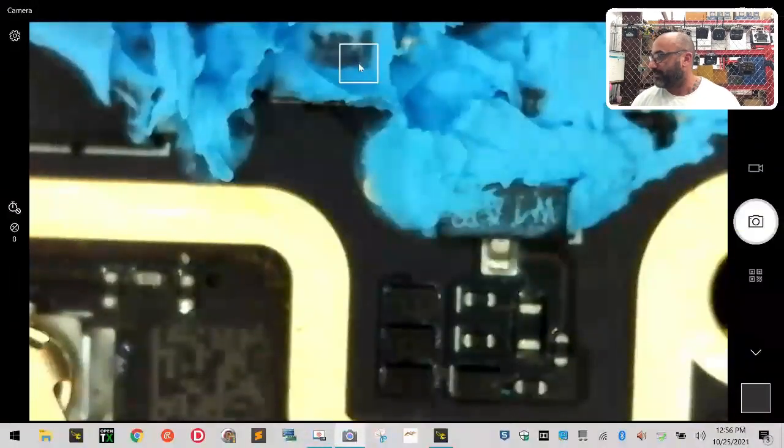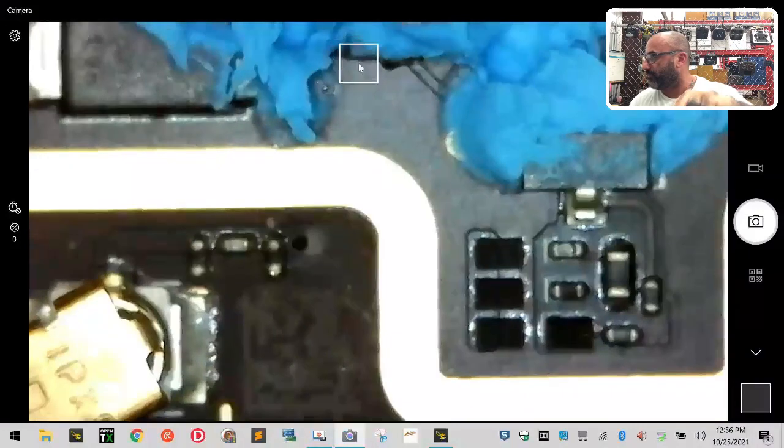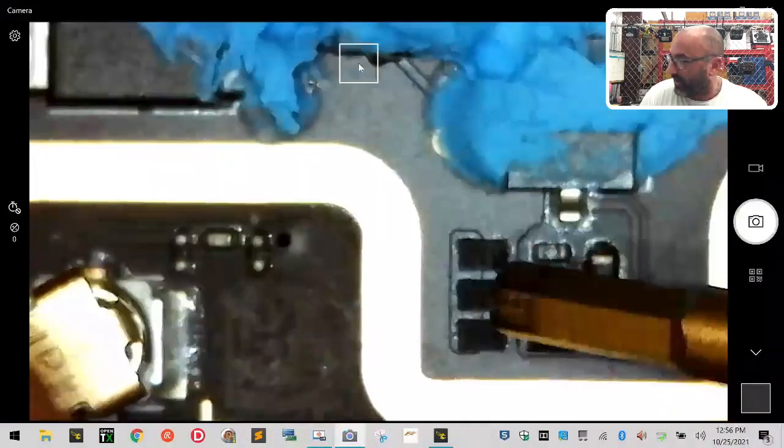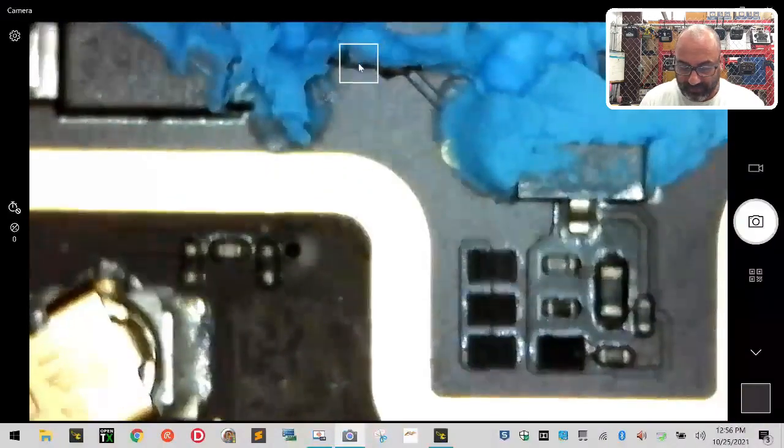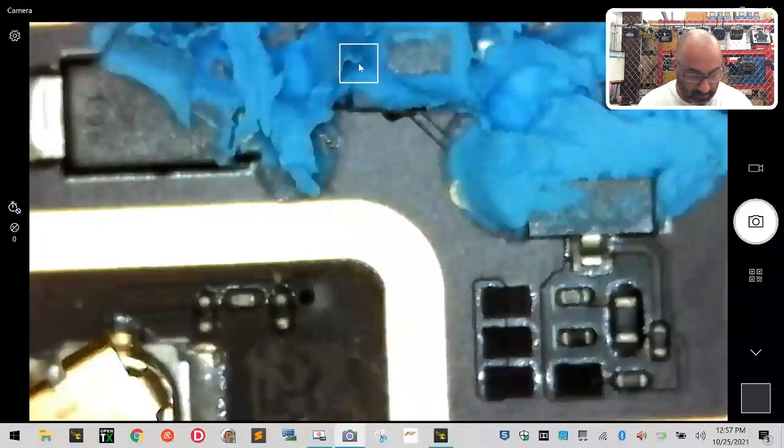We're back. I've put the Vista under the microscope. What you can see - very tiny - are the three diodes that everybody knows about: the SBUS diode, the TX diode, and the RX diode, in that order from top to bottom. When there's a voltage spike or a capacitor issue on the board, these diodes are your last line of protection.